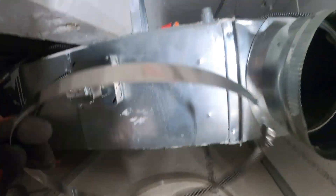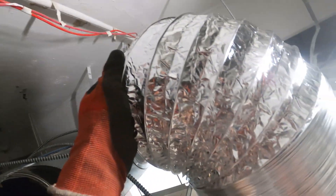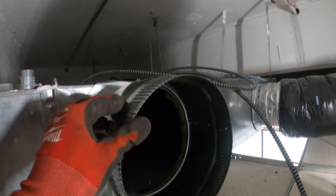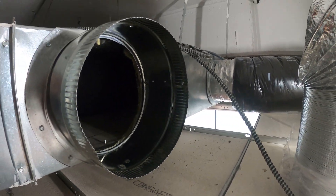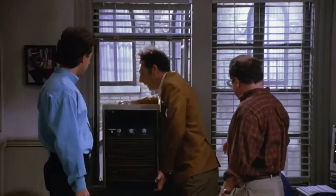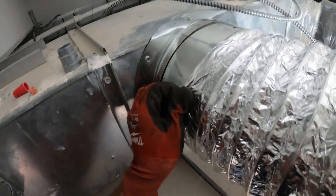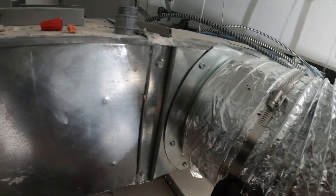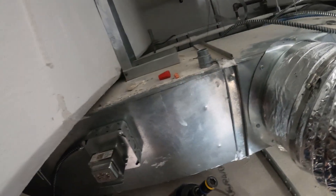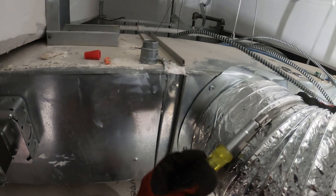What's nice is that this flex duct actually came with these rings. I'm going to start by putting that on one end in the back and then we can attach this onto the duct and secure it with this strap. That plastic moving — now that's air conditioning. We're going to wrap this around here, trying to get as flush as possible. We're flush, so go ahead and tighten this down. For some reason this bit is a bit bulky so we can't use the drill — I'm just going to use a screwdriver.